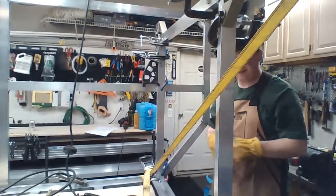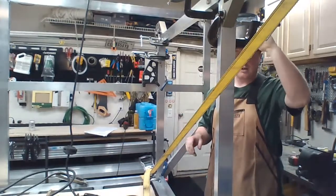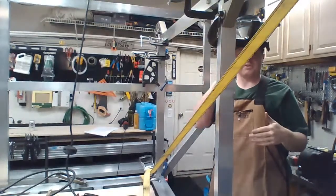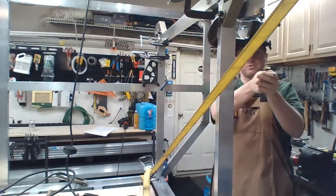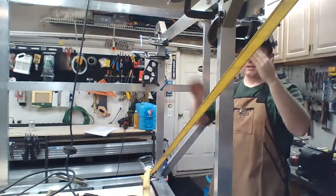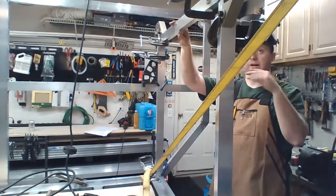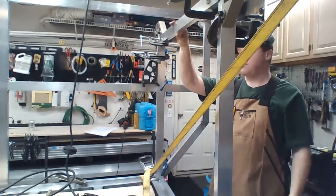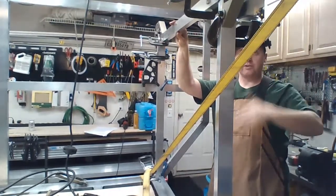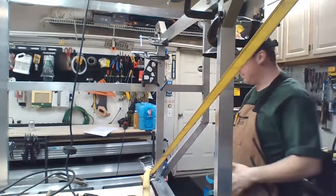Another time, and then weld that. I'm gonna weld the bottom first, then weld the top. I weld the bottom first on the side I think is going to be the most influenced, so I'm hoping it's the inside. If I do that, I can just pull back and square it up. I want the inside first because it pulls in toward this 37-inch member, which will help lock everything up. If you go out and try to fight it, you're kind of clamping it. But if you weld on the inside first, it pulls it in. You get a little more strain, I guess, but it seems to hold square.